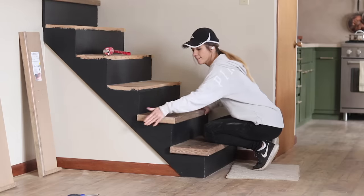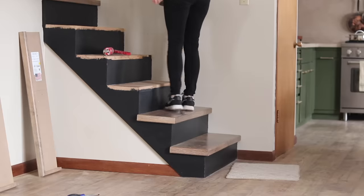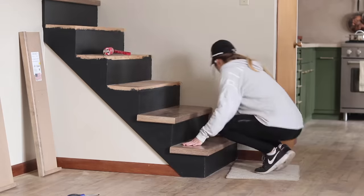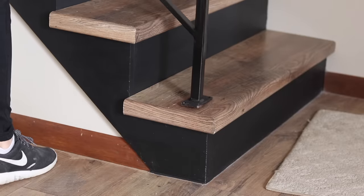You do not need to nail down these stair treads, and you do not need underlayment on stair treads either, so it's a really straightforward process. Laminate can be difficult to cut unless your blade is new, sharp, and has a lot of teeth. I didn't tape the treads into place as the glue dried — I just put some pressure on them by shuffling across. Too bad I can't do the moonwalk — this would be the perfect opportunity.